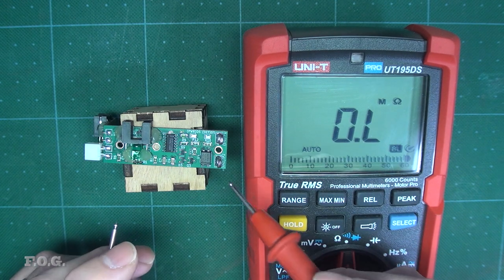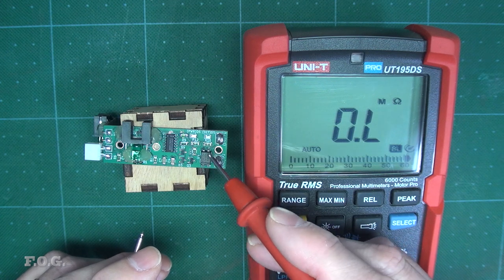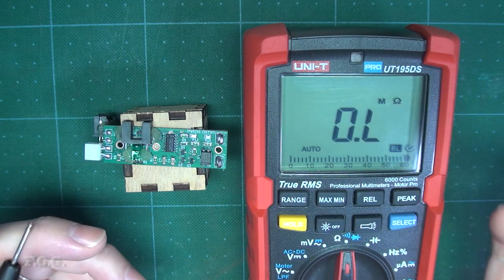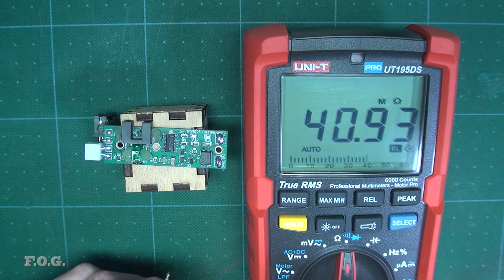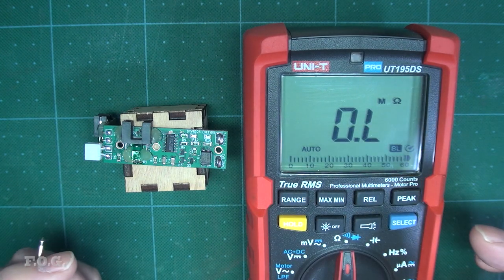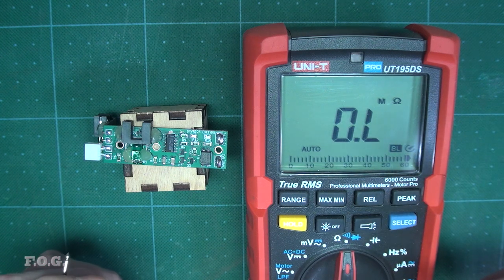It's quite interesting though. In this case it's a problem, but effectively by burning a bit of resin between two traces on the board, we're creating a resistor. So with a little bit of experimentation, it's probably even possible to use that technique to make components out of the resin on the board, which might even make some sense in some circumstances. But in any case, that might be a project for the future. For now, it's just a bit of a problem that I have to overcome.